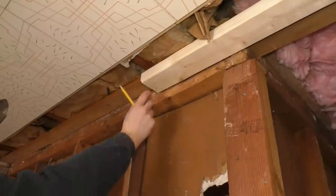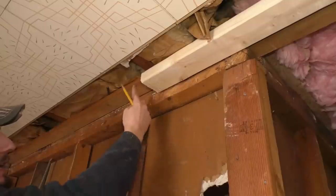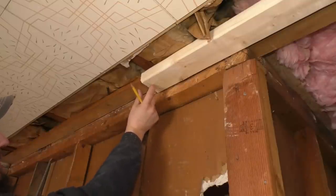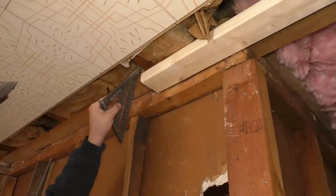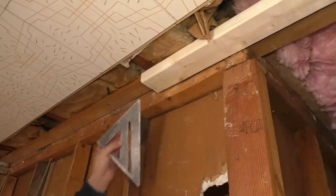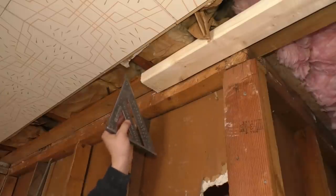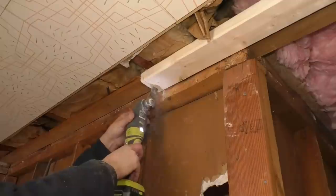When you put the stud under a split, the theory is it's holding up this top plate and the other top plate if you put it right here at the split. But on the top one, since I'm doing a double, I want it to be half on the joist so I can get a nail in here, nails in here, and both of these will be sitting to hold that joist. That's my theory.